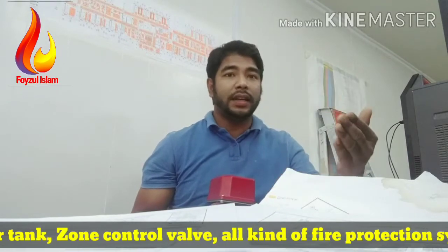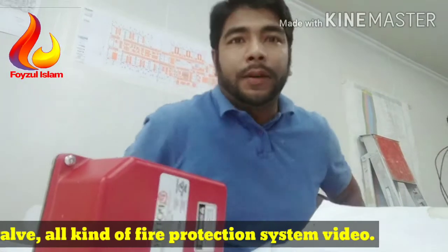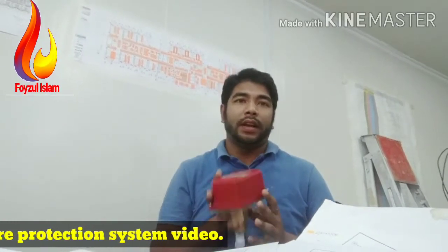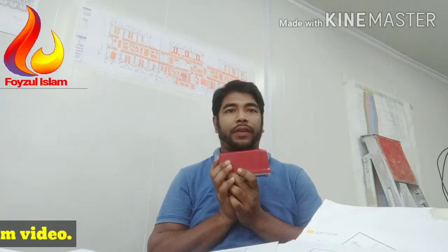The flow condition must exist for a period of time necessary to overcome the selected retard. For installation, this device may be mounted on horizontal or vertical pipes. On a horizontal pipe, it should be installed on the top side where it will be accessible. This unit should not be installed within six inches (15cm) of a valve, drain, or fitting which changes the direction of water flow.